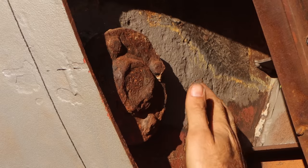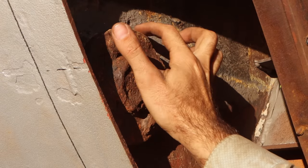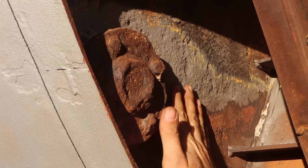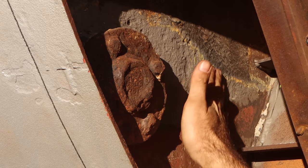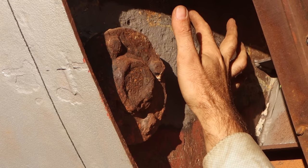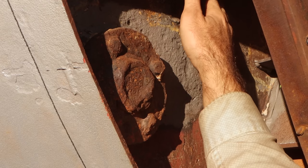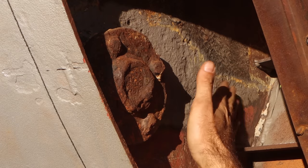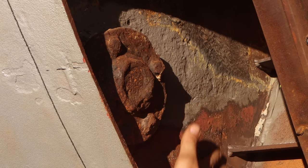I've run out of garnet, but I think I've revealed enough to know where to fix. There's a pinhole there. It's not huge, but I'll pad weld that up. But you can sort of see over in this area here, there's a lot of dimples and a lot of low spots. I will try and get a bit more garnet because I would like to extend this up. There's a spot there I want to investigate, a wee bit of rust there, and then yeah, just generally just above that line.